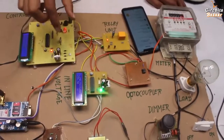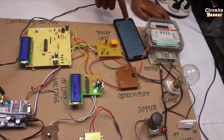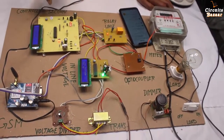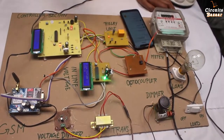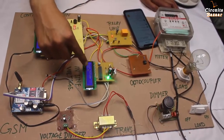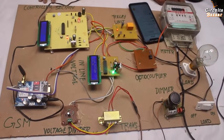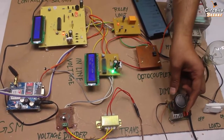Voltage was over, so I got the unsafe message. If voltage is below 100, I will get the message. If voltage is above 240, I will get the message. If voltage is between 100 and 240, I won't get any message. This is also shown on the LCD. You can vary the voltage through this potentiometer. Now voltage is nearly 158–159.